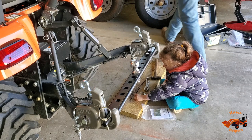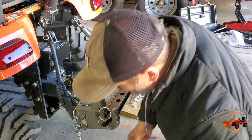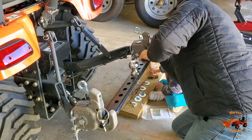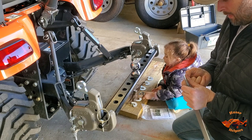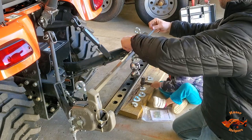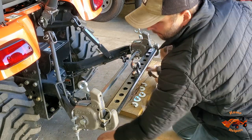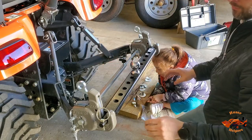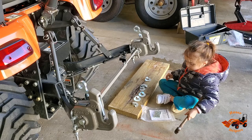Taking a tape measure and using the rod to measure out — before I forget, also need to go ahead and bend these cotter pins. Not going to flare them out too much in case I ever need to take it off again, just enough to keep them from jumping out. These have a little hairpin clip, but I'm not going to really need it. Since I know this is 26 inches, I'll give myself a little bit of slack, lock down the wiring rod, and pull out this bar. That should be the system installed — let's go hook onto the box blade.